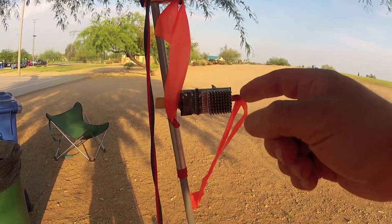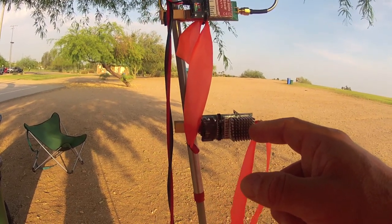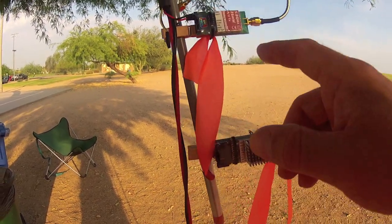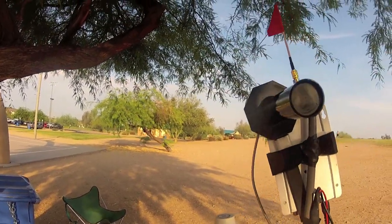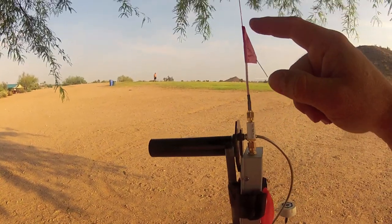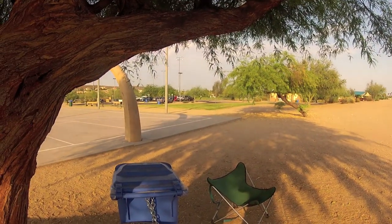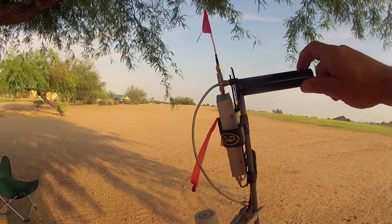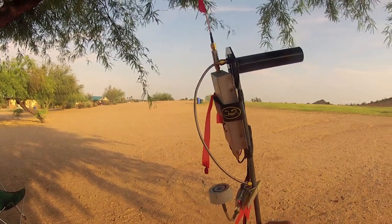By comparison, this is the 250 mW 5.8 GHz transmitter that comes with the Fat Shark goggles. I did install a heat sink, as it's not getting much airflow on the ground here, and it just turned out to be kind of overkill to have 250 mW, so I'm going to install this on an aircraft and use this lower powered transmitter as my repeater. Of note, there's the Blackhawk circular polarized helical 5.8 GHz — this could be used to repeat the 1.3 GHz signal received from the aircraft and transmit it back all the way over to my truck where I could sit in air conditioned comfort. Be sure to check out the links below for a product page as well as a discount on the Blackhawk, the Nimrod, and other Horizon FPV antennas.